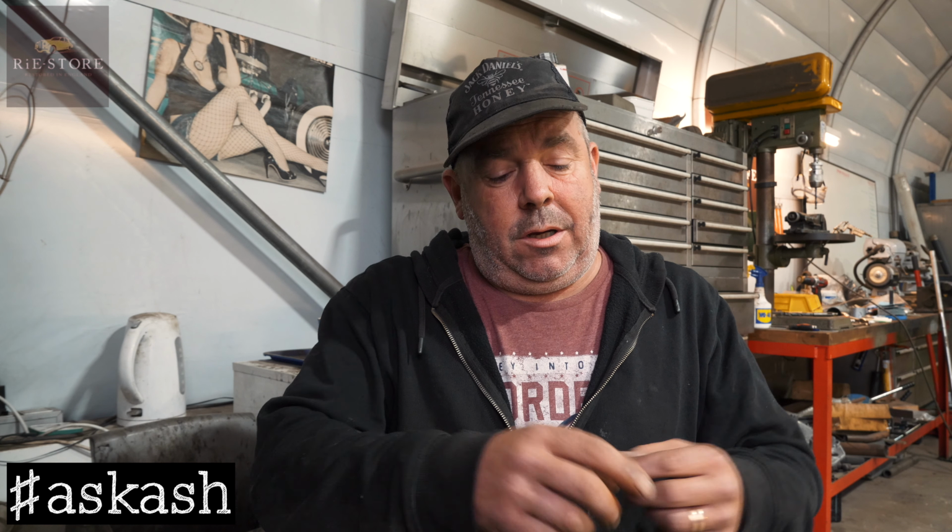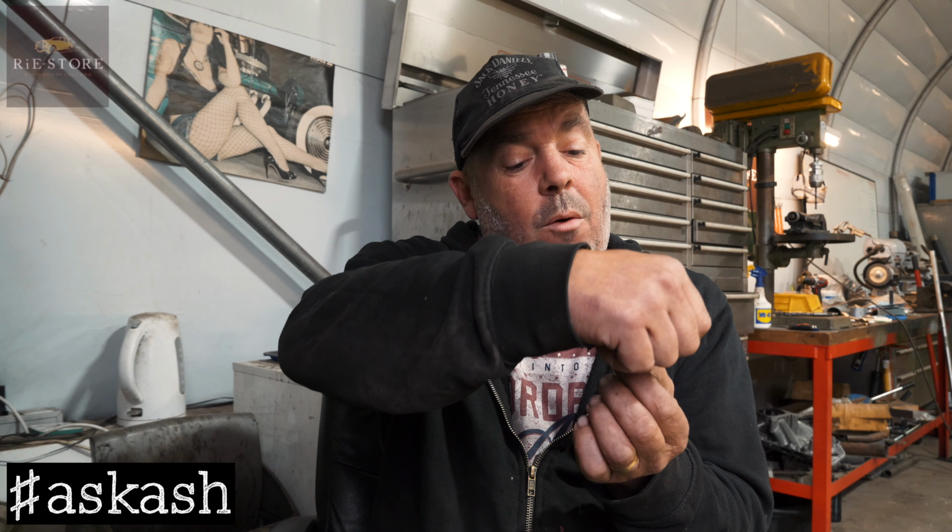Right, okay. You've got to make sure that the slider is free. Yeah. There's all different parts to it. You've got to make sure that the spiral cable that goes down through the handlebars isn't wound through the locator, which is like a disc with a groove in it. Then you put a little grub screw in the handlebar and that stops the outer cable moving. But you don't want that wound too far through because that can make your handlebar butt up. Yeah. Then you've got your slider.